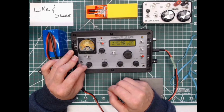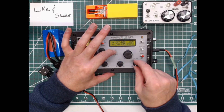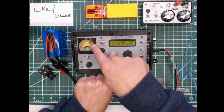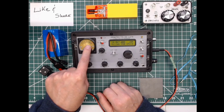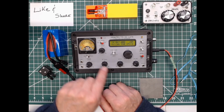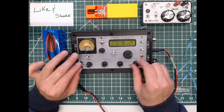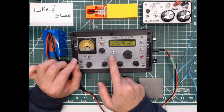Now if you hear a signal and you want to know, are you on the same frequency as that signal? Well, you do this. You can, and at 0 beats, it also gives you an indicator of your battery power as well. And in the end of that meter, it tells you. So a third function yet of that analog meter: SWR, forward power, and battery. Wonderful piece of this radio. So that covers our dial lock, our spot check, and our battery check switch.